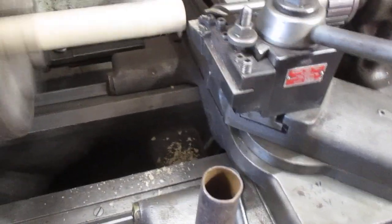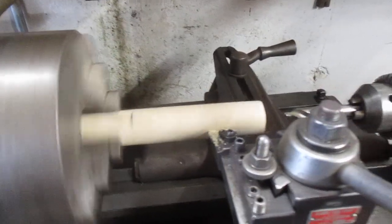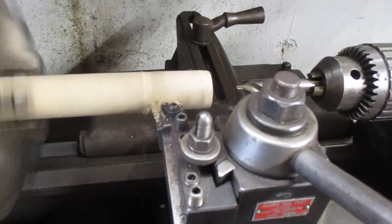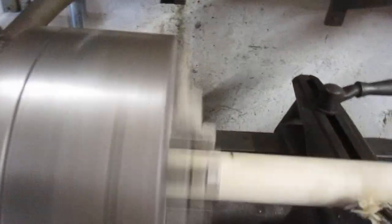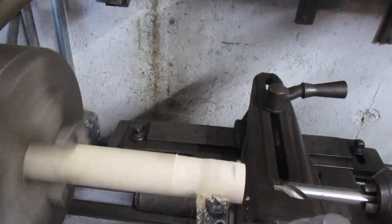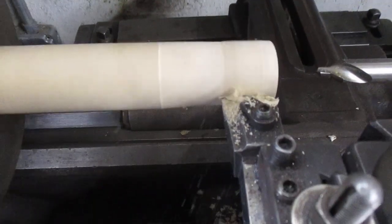Now I'm going to open this up so the feed stops, roll this back a hair, come up to about there, go in and touch off, put the feed on again. To prevent that from blowing out I've got to drill a half-inch hole in there. I'll lock the clutch in on the lathe. You can almost see a taper starting on there already - it really doesn't show too well on screen.